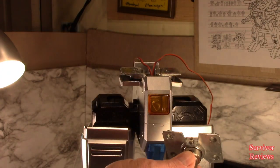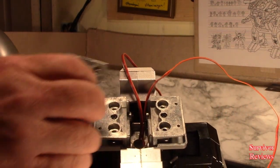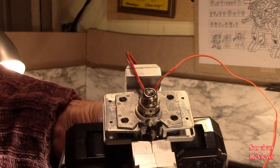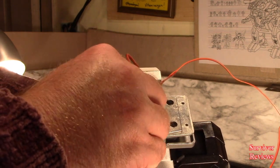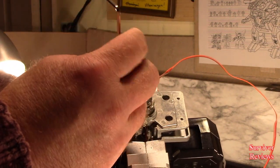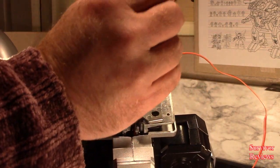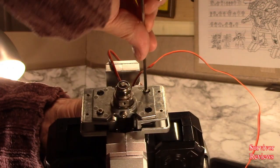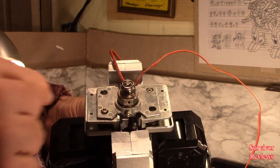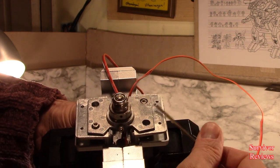So we take the piece that we just built, and it's going to come in right here and set like that. And that's going to be held in place with four M3/10s, and it's got the crimp washers in it this time. Not the lock washers, but the crimp washers. I'm not sure why, but that's one of those things, I suppose. I'm going to go ahead and buckle this down and come back. Bolt here, here, here, and here. Here, here, here, here, here.